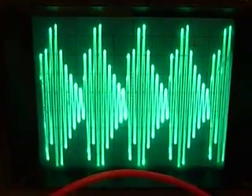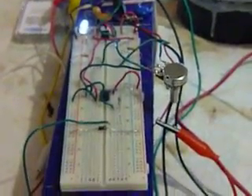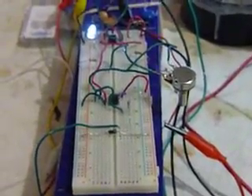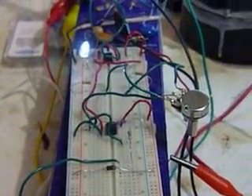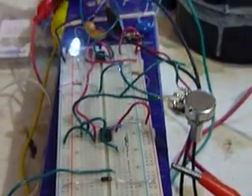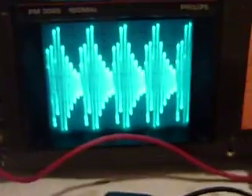I'm probably going to lose it when I start messing around with the electronics that I've built. I've built this prototype right here, and it seems to be working really well for adjusting the duty cycle and the frequency. It basically has the option to just switch out capacitors as needed to adjust how high or how low you want the frequency to go. Right now it's set pretty high — I think I just need one more cap lower to get right on the button.